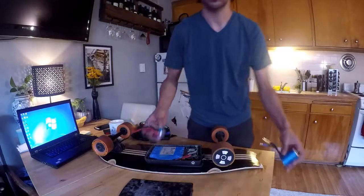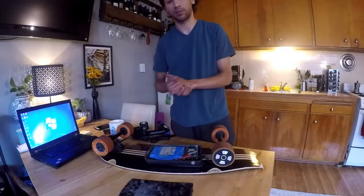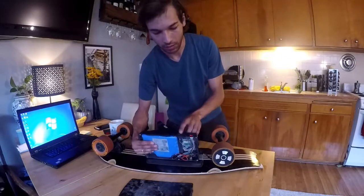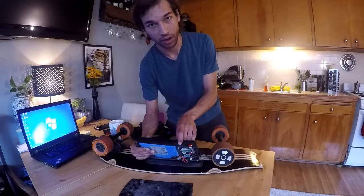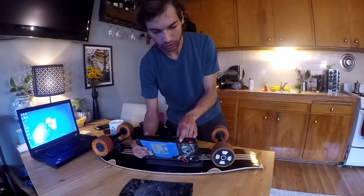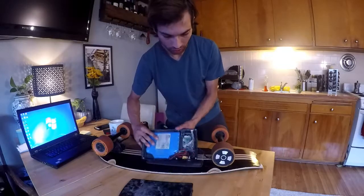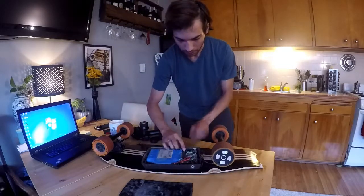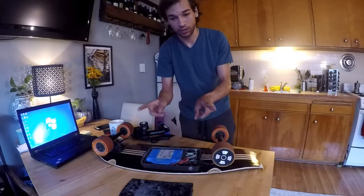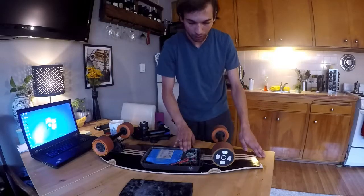And I think that's what's caused the problem — it basically won't turn off. Everything I've read online said the speed controller has the circuitry to turn it off, and sometimes a little regulator can get burnt in there or some circuits don't work. I've actually checked continuity between these two buttons — you put a little multimeter right here and switch it, and you can see it's connection, non-connection. So that button works.